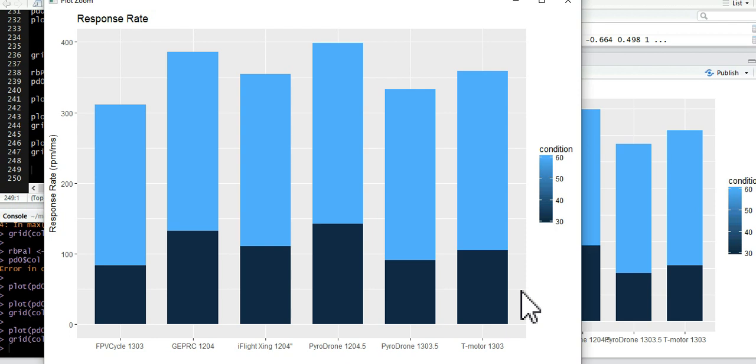To some degree, I've found that the motors with bigger punch are a little easier to tune the PID for, me anyways. I don't know, maybe I'm making that up and projecting here. But I think when people think the motors with the wider stators control the throttle better, it might be because of the throttle range. The amount of throttle you get out of any given step is probably less, so it feels easier to control, even though it's probably a little mushy. People who like a softer, more cinematic, more juicy response might like the wider motors. But I want my motor to do as much as it possibly can when I tell it to do it. For my flying style, I prefer these taller, higher kV motors that are going to have the bigger response rate.